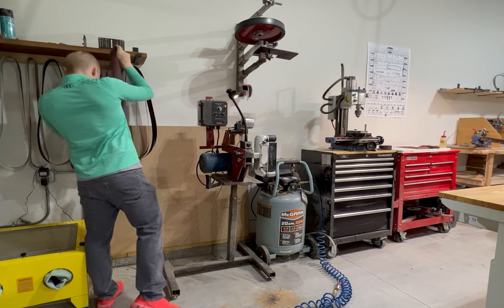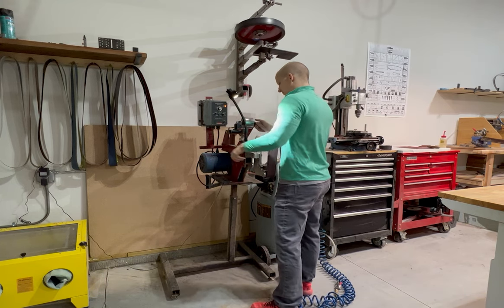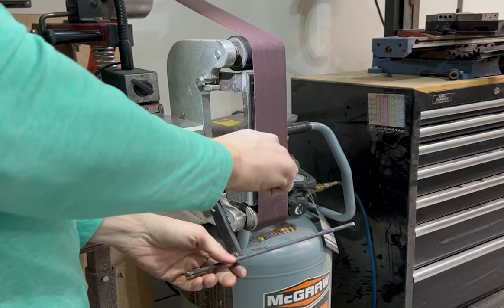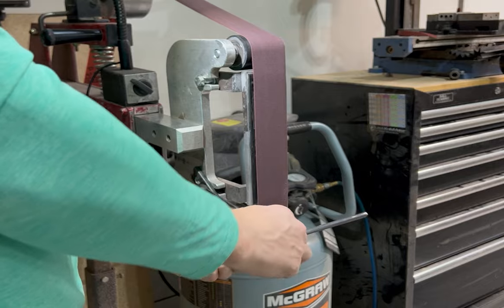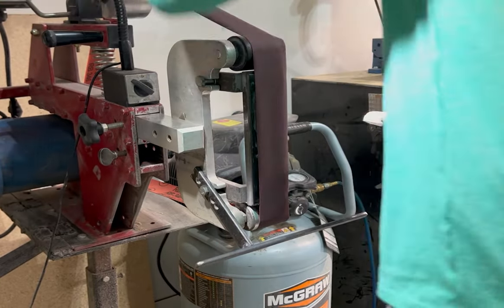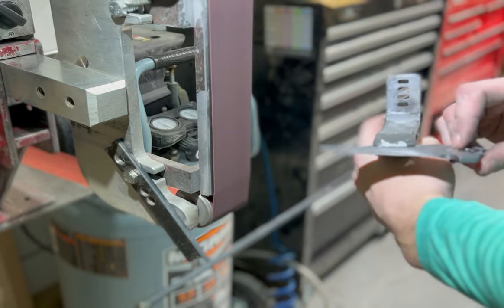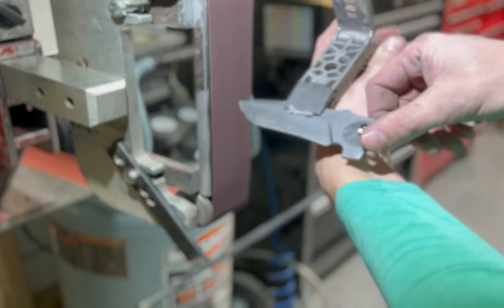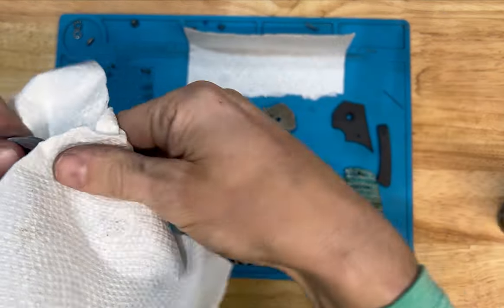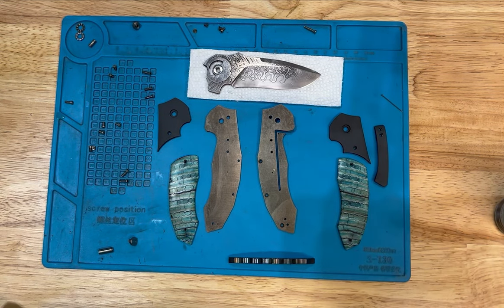Here I'm setting up for sharpening the blade. This is just a little piece of metal I welded into a T-shape with a hole drilled in it — that clamp there is from Lansky. I've kind of perfected my process with the belt grinder. You have to be careful not to ding the flat part of your blade or your ricasso. I go up through 220 and 600 grit, and then strop with a leather strop. The blade is etched, sharpened, and ready to roll — we have ourselves a cutting knife, now we just have to put it together.